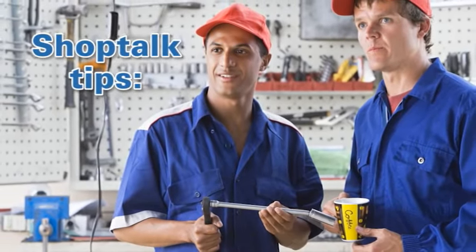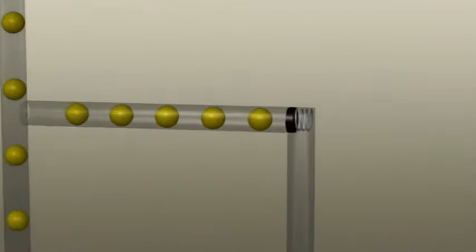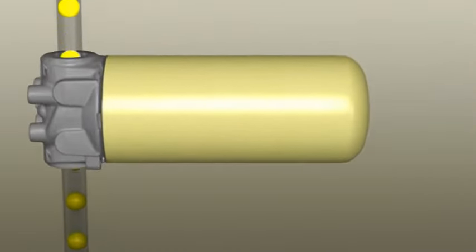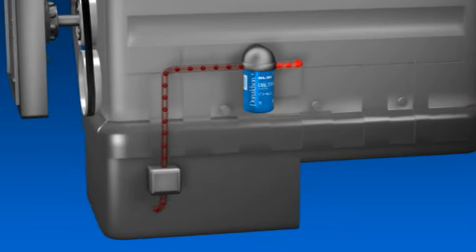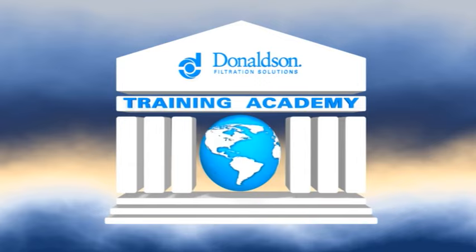Along with the service steps, here are some troubleshooting tips. This is a simplified engine lube circuit in normal operation with the pressure regulatory valve open and operating normally. Note that the pressure regulating valve in the lube circuit has become stuck in the closed position, resulting in much higher than normal pressure being exerted, causing the filter to dome at the end. Here is a photo of a filter doming because of excessive pressure built up in the lube circuit. Unnaturally high lube system pressures have inverted this tap plate, and this filter has developed a vertical crack indicating pressure fatigue. If you notice any of these telltale signs of excessive pressure in the diesel engine lube circuit, it will be your opportunity to solve developing problems before additional damage is caused.